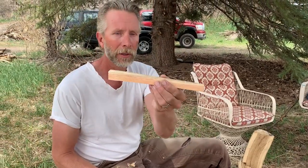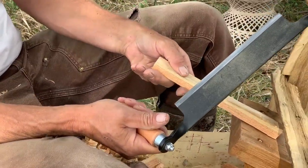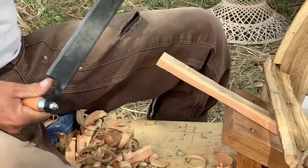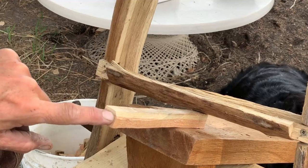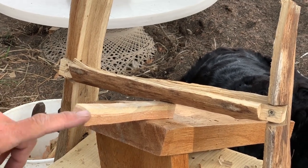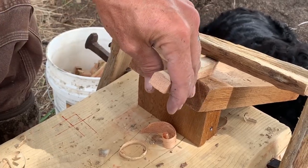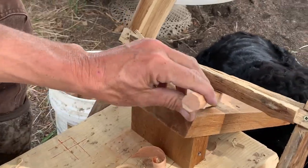We have a nice blank, three-quarters of an inch all the way around. We will pull off the corners by setting the stock in the vise and holding the draw knife at a 45-degree angle. If you look at the end here, you can see I've got that 45-degree angle, and essentially I'm looking for every one of these surfaces to be approximately the same length — about three-sixteenths. There's the other one, then I just flip it over and repeat. Now we have an octagon.